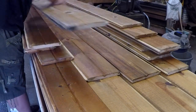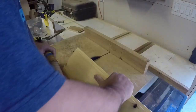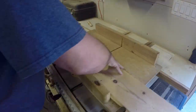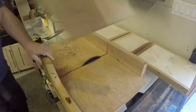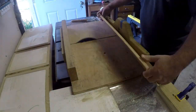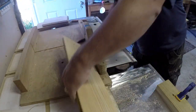Now that I've harvested enough of the shiplap I can get them out to my shop where I can remove any major marks, cracks, and other problems that might cause me headaches going forward. Using my table saw sled I was able to get through these first cuts relatively quickly — not much to do here, just find the junk and cut it off. Once done I added a stop block to the table saw that allowed me to quickly and easily index the boards and cut them to the same length.